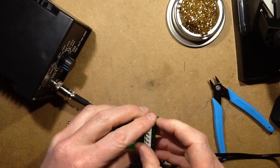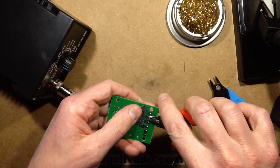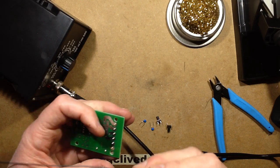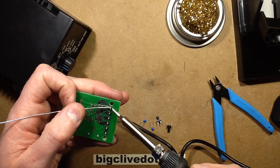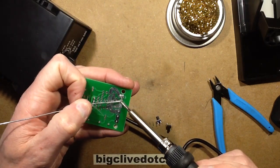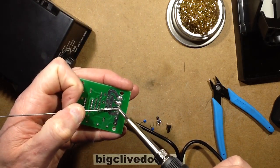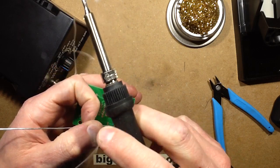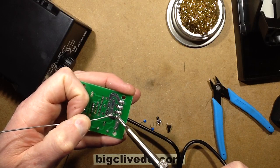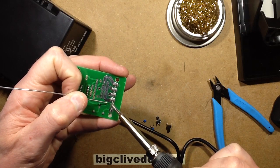So let's try something beefier. Now, when I put these terminals in, I like to just hike the leads up, make sure they sit up snugly, because these are rising clamp terminals, and I'm going to be using the thicker solder for this. This is a much larger mass device to solder. And it's handling it absolutely fine. Let's see how it holds its temperature. I'd say it's falling off a tiny wee bit with the larger connections, but not that much. It's still perfectly acceptable.